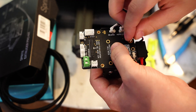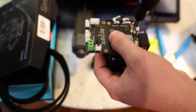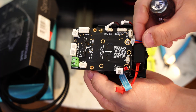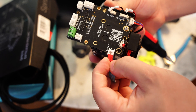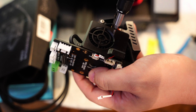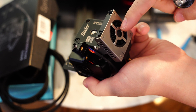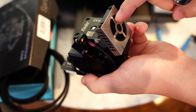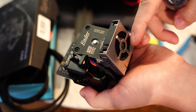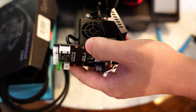We're going to take our motor board and just fit it in right here. I'm going to install this bottom screw to help hold things in place and tighten it down. Then I'm going to plug all of these connectors back in and get our heater plugged in. I plugged in the fan labeled F1, which is the hotend heat sink fan, so this will spin. I didn't include a port for the part cooling fan — I recommend upgrading to a different part cooling fan because this one really doesn't do the job well. So I'd just remove it by undoing the bolts.